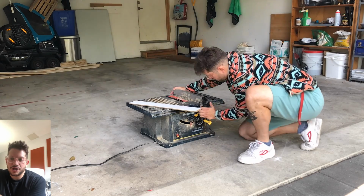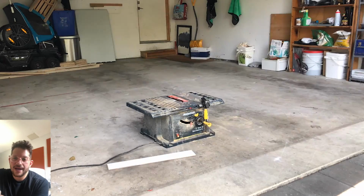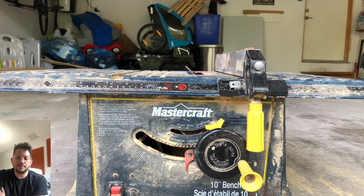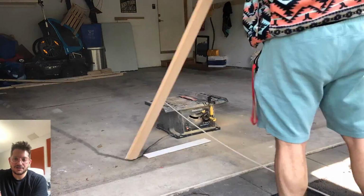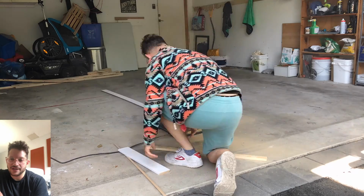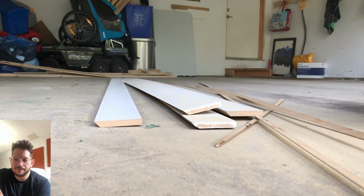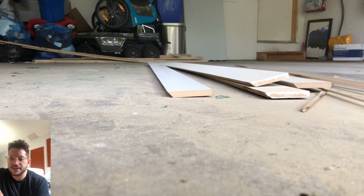So I'm using a 4-inch MDF by 1/2-inch casing. And I'm just cutting the one edge on a 45 degree. You can see I just set up my table saw and fence there. And this is what's going to allow the trim to butt up nicely against the ceiling and the bulkhead drywall. It's just going to give us a nice flush mount to the trim and just really tie in that bass trap with the wall. Just make it look like more of a built-in rather than just a mounted product. This is more of a built-in to the wall and ceiling type of deal.